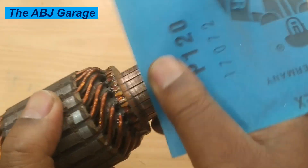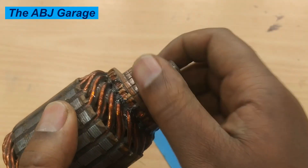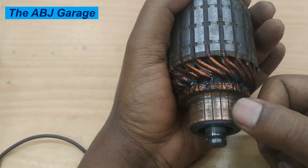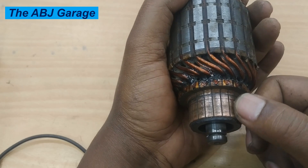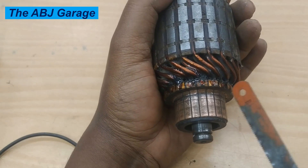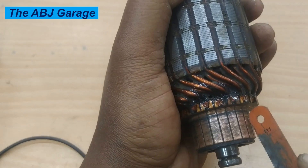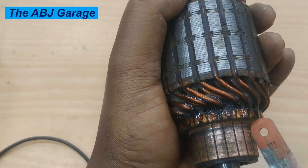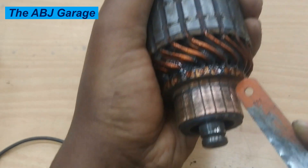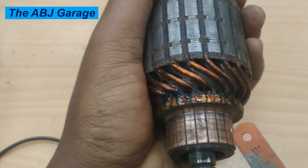The commutator parts are now a little shiny, which will make resistance measuring easier. It is also a good idea to clean the gaps between the commutator segments so that any conductive debris can be removed. For that you can use an old hacksaw blade to clean out the gaps. Removing any carbon debris from previous carbon brush filings will help get accurate readings.